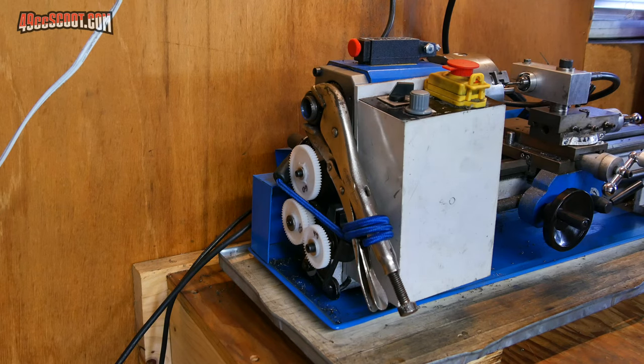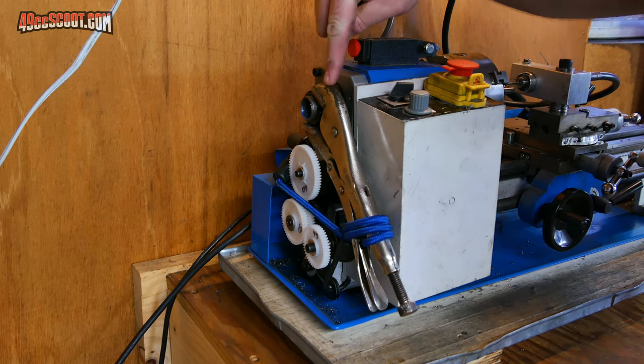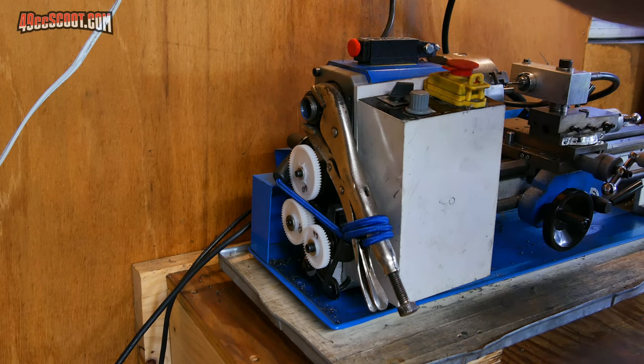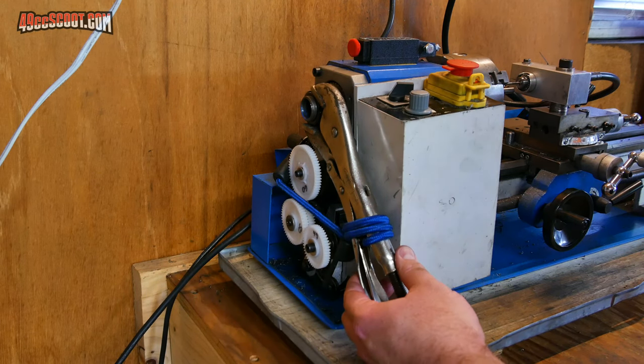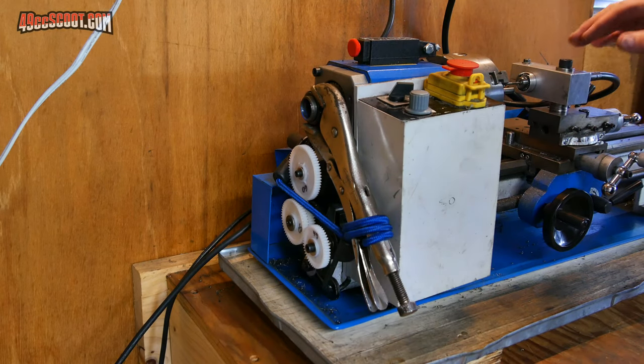It's a good idea to try to hold the chuck in place when you're using the tool post grinder, and a simple solution that's worked pretty well for me in the past is just what you're seeing here. I took the back cover off, I've got a pair of vice grips, I just clamped them around the spindle nuts up here, and then I use a bungee cord to keep pressure on them. And it could still move, but it would take a good bit of pressure to move it that I haven't seen this cutter try to put on it yet.